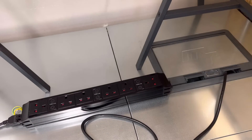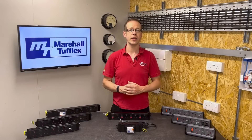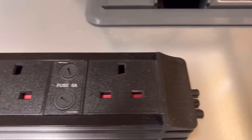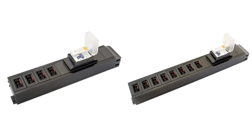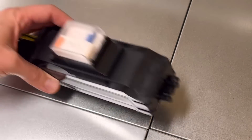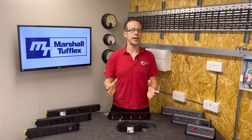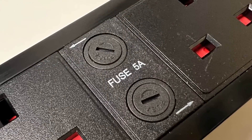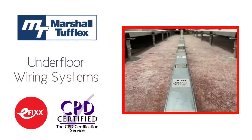There are so many options with this kit. There are choices of two, four, or six gang outlets, unswitched, individually switched, or with a master switch that turns the whole module on and off. If you need to provide RCD protection, there's a few options: an RCD built into the power module itself, a distribution feed unit that protects any power modules connected via the GST sockets on the front, or a single RCBO module that protects any sockets connected downstream. You can also use individually protected RCD sockets installed directly into the floor boxes. The sockets are individually protected by fuses — not 13-amp like a plug top, but much smaller at 5 amps, or on the six gang modules, an unexpectedly specific value of 3.15 amps. You'll find the explanation for that in the free training package linked in the description.